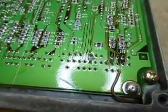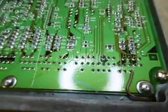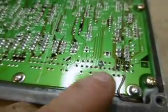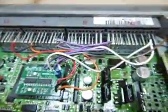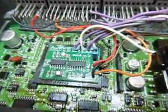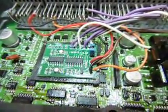When that signal on that line is pulled down to ground, then the IMA light will flash, as will all the other error code lights on the dash, to flash out the blink codes. So what you do is you solder a wire onto that, route the wire through, and eventually it will come through and onto the circuit board. And the actual details of the wiring on the circuit board I'll cover in another video.